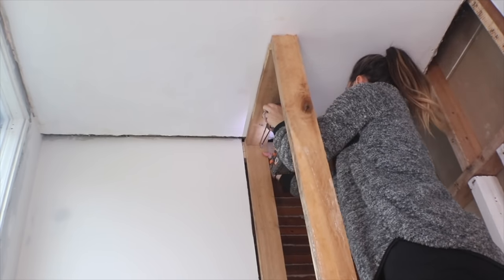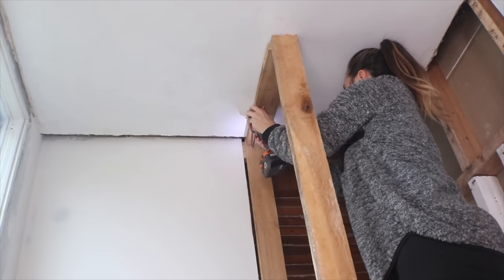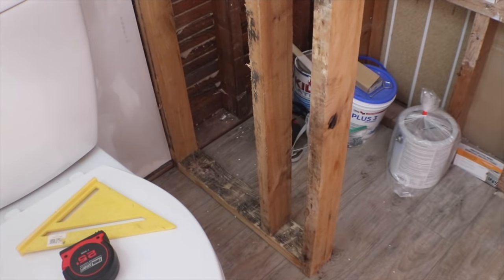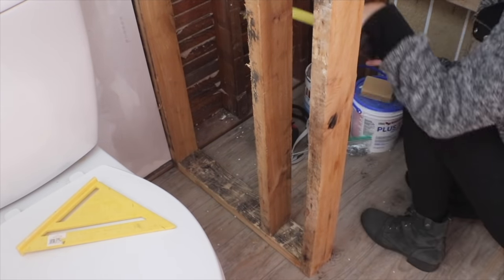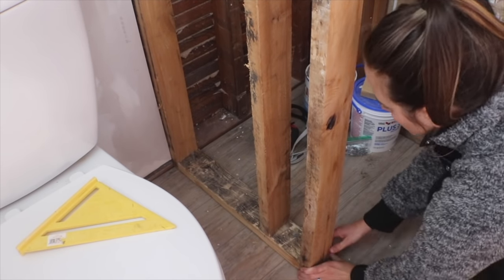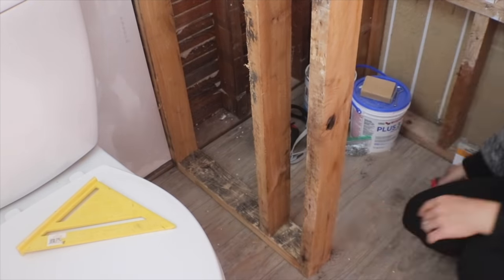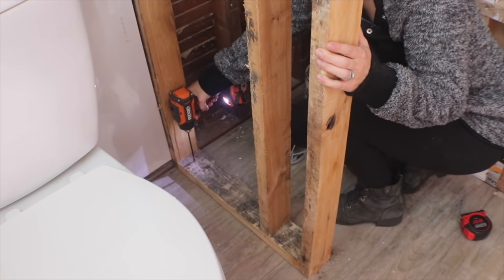I screwed the framing for the wall I'm adding into the existing wall framing. I did have to add a little 2x4 up there, using my Kreg jig again to drill the screws at an angle and tie it into the existing wall stud framing. For the floor I also screwed it in, but not before measuring to make sure everything was as square as possible and that it was the right length away from the toilet — the center of the toilet to the edge of the wall is 16 inches. This was pre-planned when the plumber came to move the rough-in plumbing.